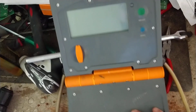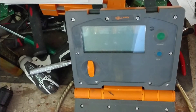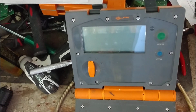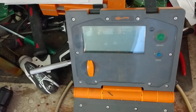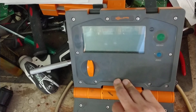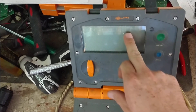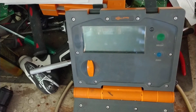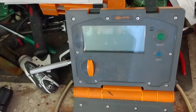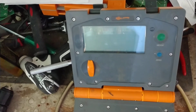Hopefully that makes sense. If you have any questions on how to calibrate your W210 weight scale, give me a call — happy to do it over the phone. This video should also help if you need to double-check anything on troubleshooting. If you've got another Gallagher model — the 310, 610, 810, old weight scale, Smart Scale 600, 800, 700, 300, or 200 — they're all done differently, but the basic process of zeroing, adding weight, capturing, and saving is essentially the same. All our information is below. Our website for weight scale and cattle scale repairs is cattlescalerepair.com. Until next time, we'll see you later.